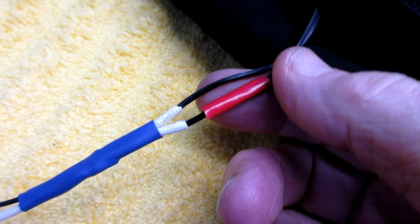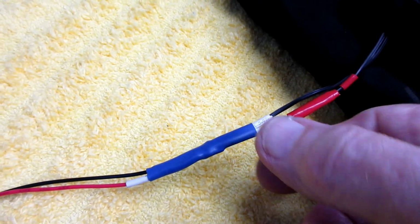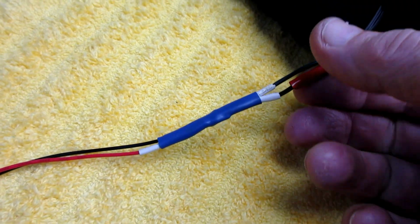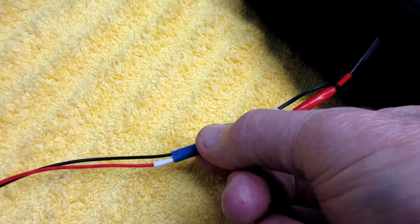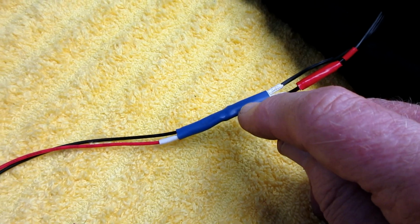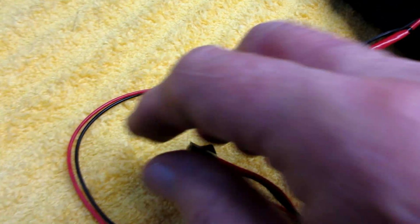I think that connector, I put an extra piece of red tape on positive, so if I ever have to take this apart, I will be able to. All the connectors have the positive wire in red. Of course the jacket doesn't, so this would make it easier if I ever have to take this apart. But the joints in here, even if this were to come apart, they're staggered. They're not side by side, and that's a safety thing.